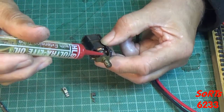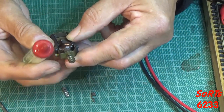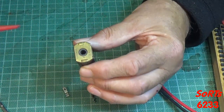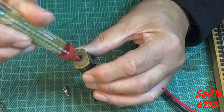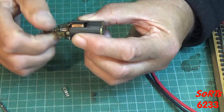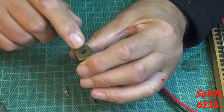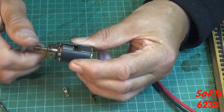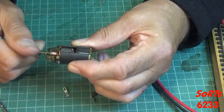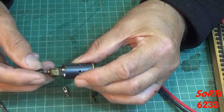The forward bearing — there — and that will work its way through. The rear bearing seems accessible through this hole, so let's drop some oil in there and that should be good. I'm wondering if there should be a reservoir plug in there, but I'd have to investigate that. At the moment the bearing is lubricated. And now I'm going to reassemble the motor and test it.